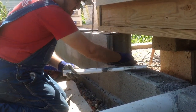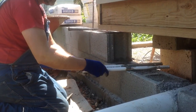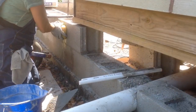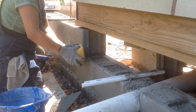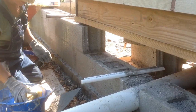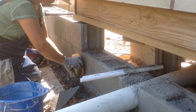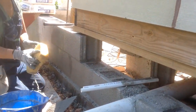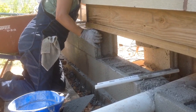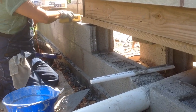And now that we're here, we're going to need to do the same thing for the next one. So once we get our mortar down, we'll give you another demonstration so you can see it again. Okay, as you see, Linda's got a wet masonry sponge, just to clean your grout lines, mortar lines, same thing. Levels them off and gets the mortar off of the surface and leaves it between the blocks. She's doing both sides. Get it done right. Now she's ready to do the second block.